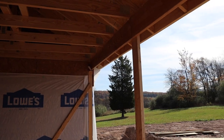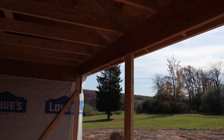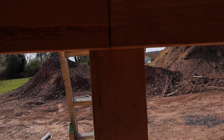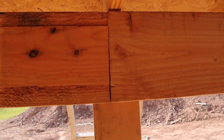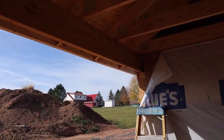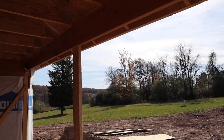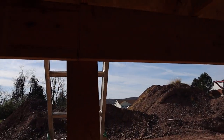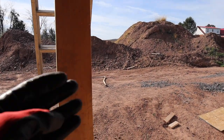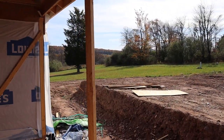There's the beam looking down the run we've got so far. There's a splice at this temporary post and a splice right here — that's our first run through there. This is nice because it gives us a place to put our temporary post. Now what I'm going to do next is put an actual temporary post that's going to hold the weight coming down right here.